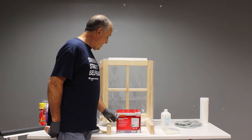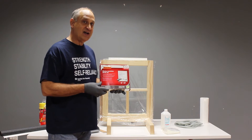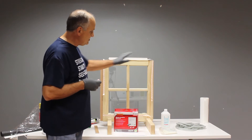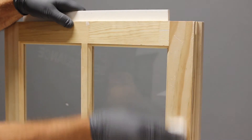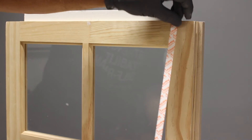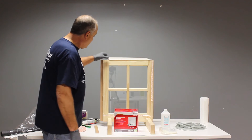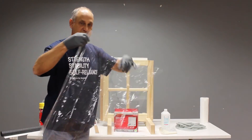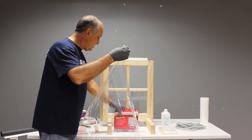One of the other things you can do is install a window insulation shrink kit to your windows. Many manufacturers produce these in multiple sizes, so get the one that most closely fits your window. This is a pretty easy process. What you want to do is measure out your window and then install your tape down and around the entire window. After you've wiped down your window frame with alcohol, take your two-sided tape and attach it to the frame. Once you have your tape in place, remove the backing and cut the plastic to the size that you'll need. It doesn't need to be precise — keep yourself a little extra space on top, bottom, and sides, because you can always trim that up later.